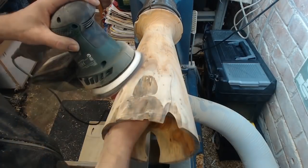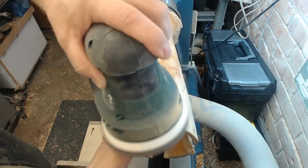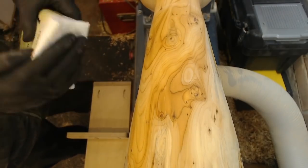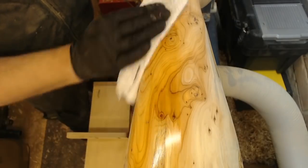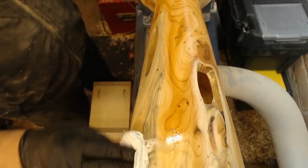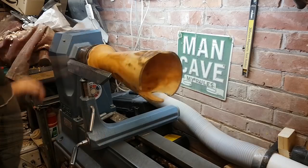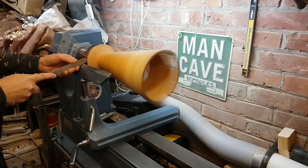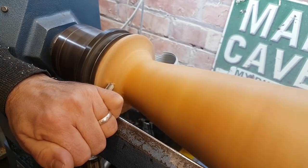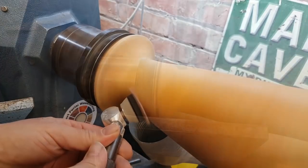Power sanding — never underestimate the usefulness of a random orbit sander. I actually use this sander quite often, on platters as well — much quicker than using my drill or sometimes an inertia sander. And just to see what it's going to be like, here's some oil going on — I'm using hard wax oil. All in all I probably use three coats, not to give a great big glossy shine but to give a bit of a sheen, which does enhance and bring out the grain nicely. So I need to finish up that rather messy foot at the bottom — going in with a parting tool, really just to give me the bottom of the foot clear, so I can trim that using a little spindle gouge. It was still a little bit too thick, so I went in again. Sanding, finishing off that transition point, and obviously that would be re-oiled again.